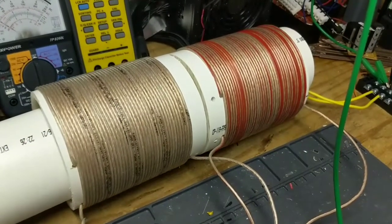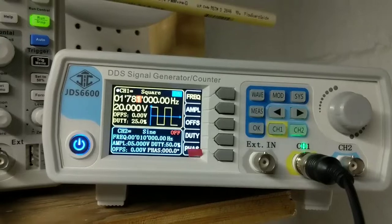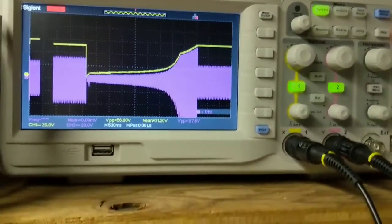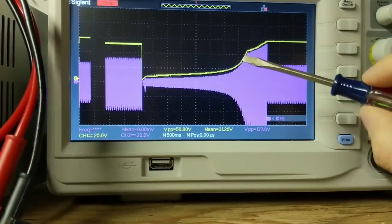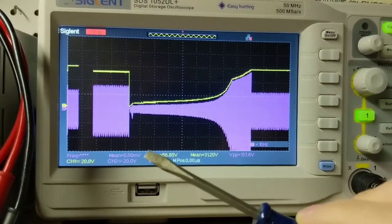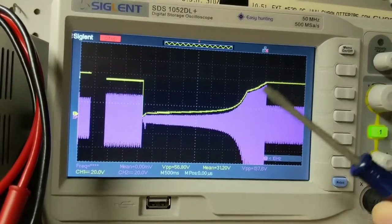I have the bigger coil setup here running. Now let's take a look at our typical approach — I'll short out the capacitor, and in this situation you're going to see something interesting. Running on this coil setup at about 1.78 megahertz. As you see, the trumpet wave starts to rise, but then almost like we have two separate trumpet waves. One seems to be coming from one of the other coils, and then it hits its final voltage earlier. As we've seen from previous experiments, there's a band that you operate within. On the low side of the band, you get a lower final voltage but get there more quickly. On the high side of the band, you get a higher final voltage but it takes longer to get there. And I think this is exactly what we're seeing.